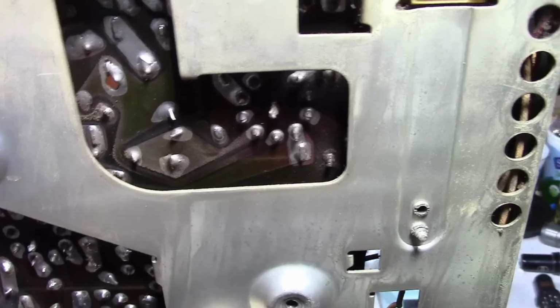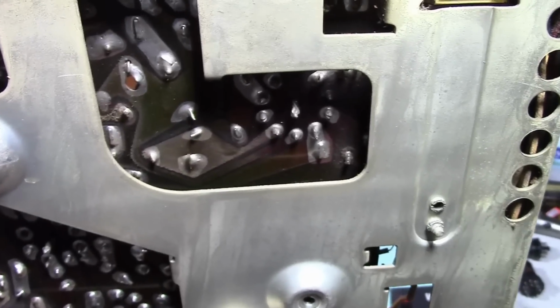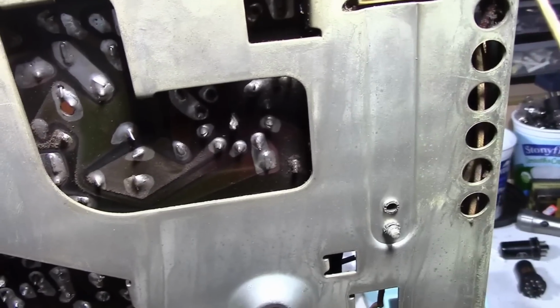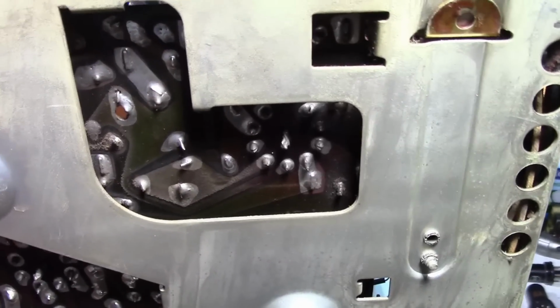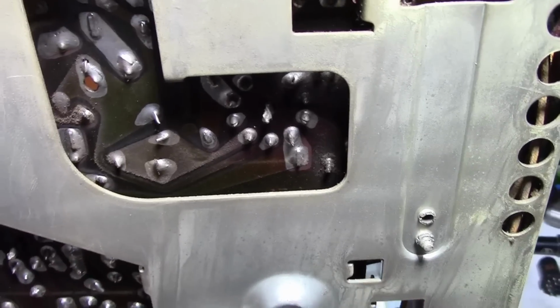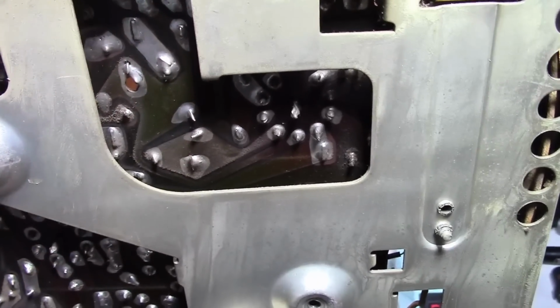You could use solder wick or a solder sucker, remove the solder, straighten out the lead, and pull it out from the other side. But an easier way to do it, for most of these: cut the lead off on the other side, flush to the board, heat it up, and just pull it out of this side with the lowest heat setting you can get away with. There's very little stress on the board, no issue with the lead being bent over, it'll just pop right out of the side.